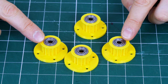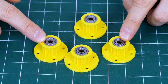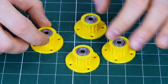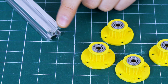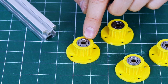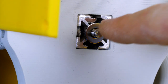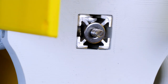The other pulleys are slightly longer and have a longer extension on top, meaning they're wider and I can fit a 6mm internal diameter bearing in. The knee pulleys are much shorter with less clearance, so for these I put a 5mm internal diameter bearing in, though that leaves a very thin wall. These face a piece of 2020 extrusion which holds the whole leg on, and that's got a hole we can tap to 5mm — ideal for the 5mm hole. I've taken the outside of the leg off and fitted that 5mm piece of studding tapped into the aluminium.